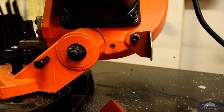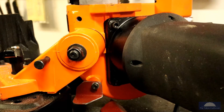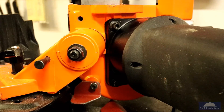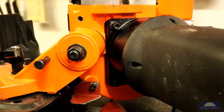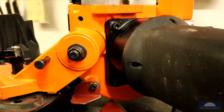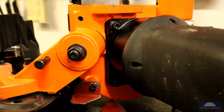I changed my mind. Instead of having the bracket go against the orange aluminum part, I've decided to put it against the steel bottom part. It seems a little simpler and maybe more solid, because the steel bracket going into the aluminum part would eventually wear. The pressed steel part seems to be more than thick enough that it will stay fine. Now I want to put a pin in here so this doesn't move. I've searched high and low — I thought I had some roll pins but can't find them. So I've got an old 2mm drill bit that's busted off. I'm going to drill a 1.9mm hole and drive the broken shaft of a 2mm drill bit into there. That should hold it.